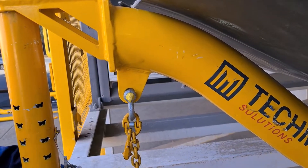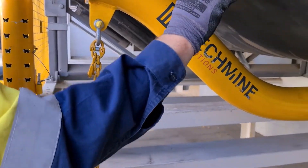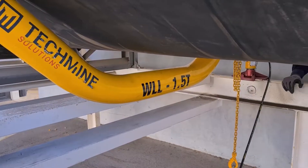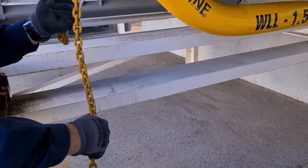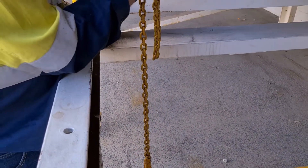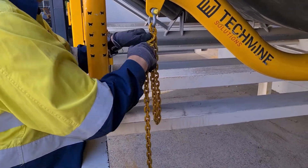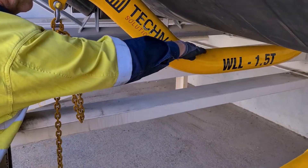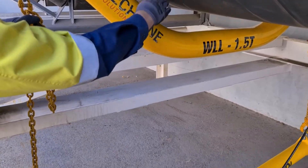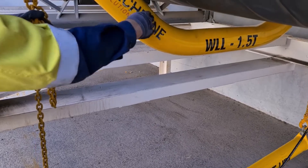When we're working on a return belt and looking to change out a return idler, and we're not actually looking to lift the trough beam, we want to gain as much lift as we possibly can. We lift our return belt to a point where the beam is connected to the return belt. That allows us, due to the capacity in the belt and from our trough beam, to start lifting the return belt before it's lifting the trough belt. That'll increase the lifting capacity we can create on our return belt.